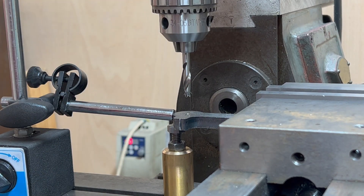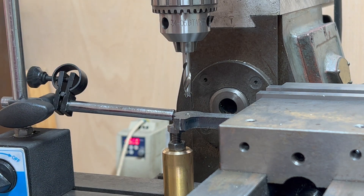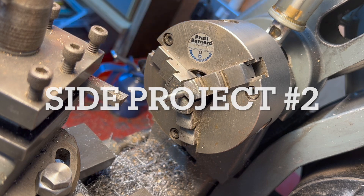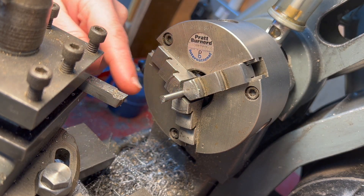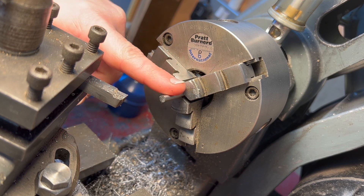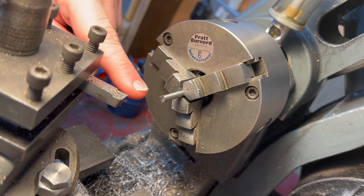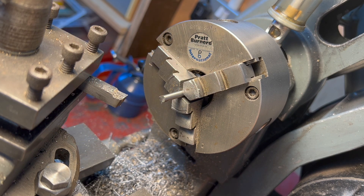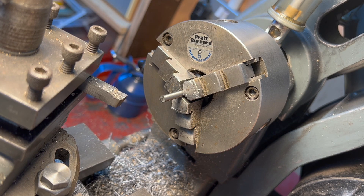I'm pretty sure you've all seen drilling before, so I'm going to skip all the plain drilling stuff and just take you back when I'm doing something interesting. The idea here is to make a couple of pins. I'm going to cut a 60-degree point on the end of this silver steel ground rod, then turn down the OD to one-eighth of an inch, and that should give me a shoulder pin to use in the coupling rod alignment.